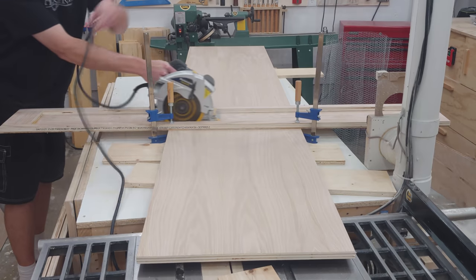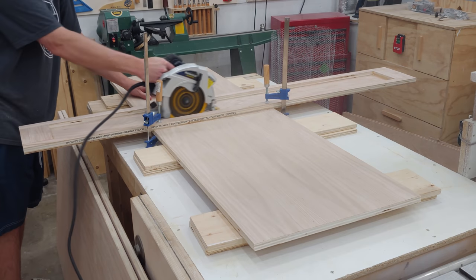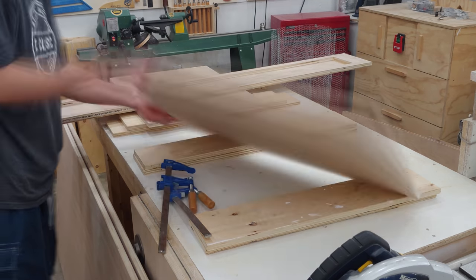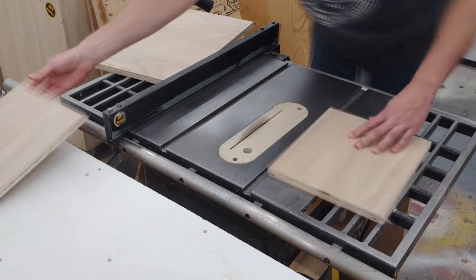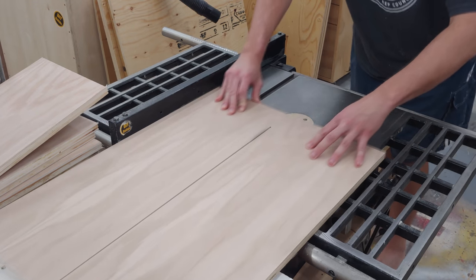For all the wide cross cuts, I used my homemade track saw guide, which I had whipped together just for this project. It's just a piece of 1/4 inch plywood on the bottom, and some straight scraps of 3/4 inch plywood surrounding the width of the circular saw shoe. This track guide creates a zero clearance effect and totally eliminates any chip out on the very prone to chip out oak plywood. This project requires 4 whole sheets of 3/4 inch plywood.